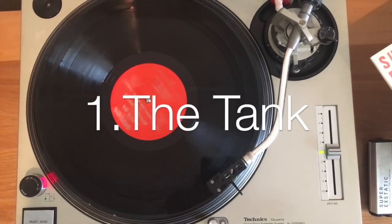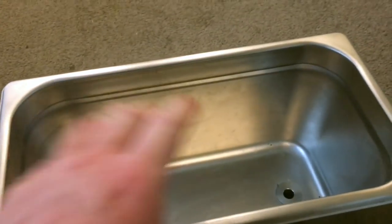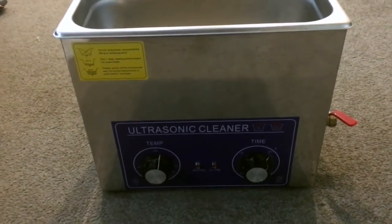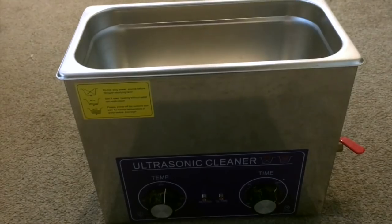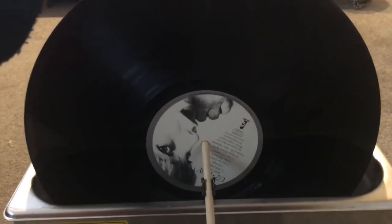So this is the ultrasonic cleaning tank itself. What I'm going to be doing is building an attachment to clip on here where you can rest the record and clean it. You can get these fairly easily off eBay — this is just a six-litre one. I might post a link below to the one I picked up. It's got a power supply on the back, and the idea is your record will sit here with attachments on both sides, and a dowel will sit across here where the record can rotate. It needs to be just high enough that it's not going to touch the sides, and low enough that the water level will reach just the bottom of the label.